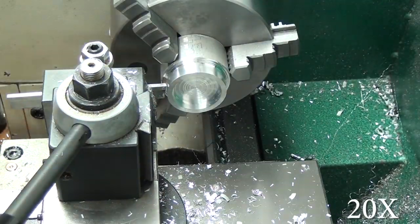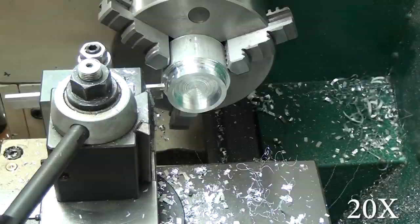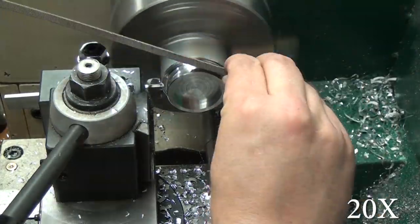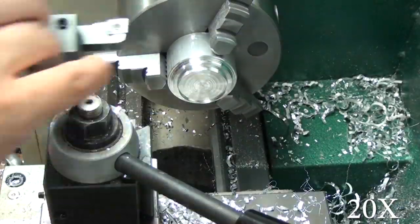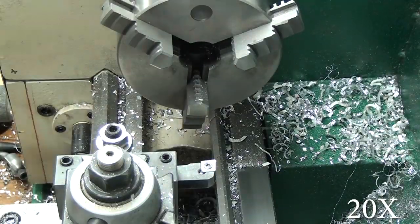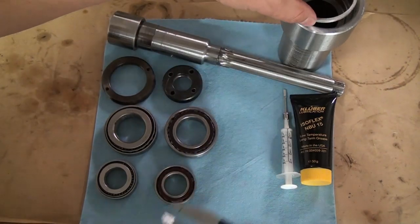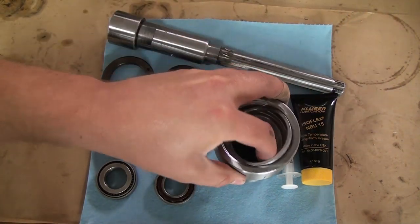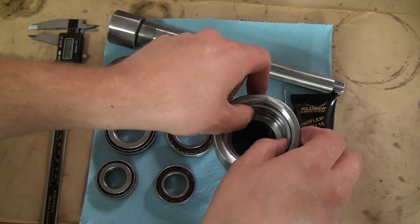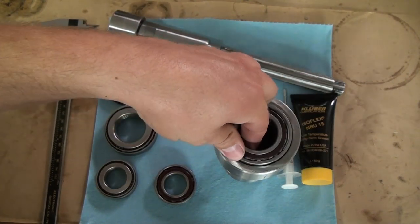What you're watching here are the spacers I'm making on my G0602 lathe. You don't need to make spacers — you can actually buy shims from McMaster, and those part numbers are also over at Haas's website. But you do have to have one or the other, because the new angular contact bearings are thinner than the original two-piece roller bearings and you need to make that up with a shim for the lower bearing.